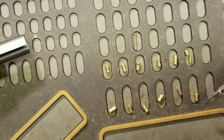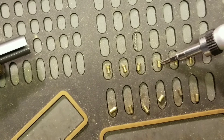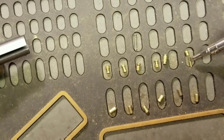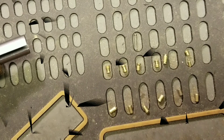So to summarize: all standards on the bottom, and then the driver pins are: a commercial spool, a commercial spool, a pin-and-pin, a commercial spool, a homemade serrated, and a pin-and-pin slash two-piece pin. That's all I've got for you today — please like and subscribe, and don't do anything illegal. Bye!